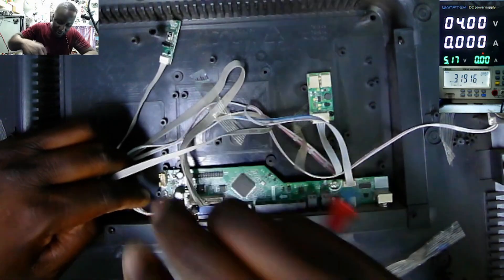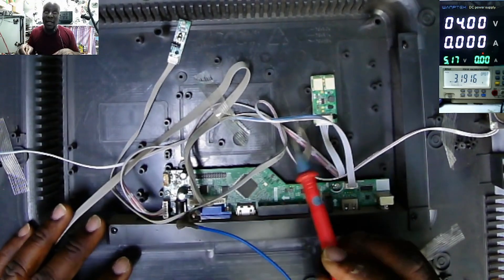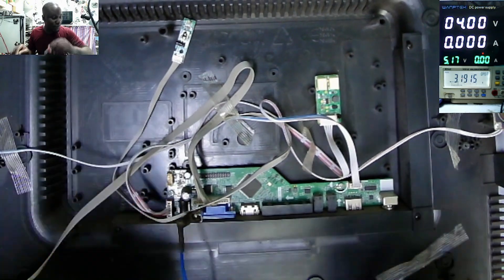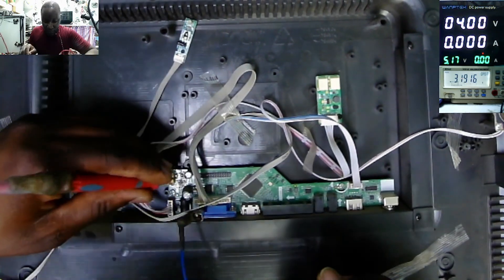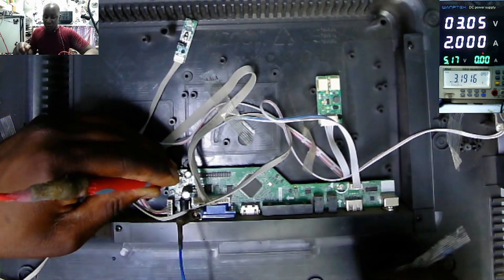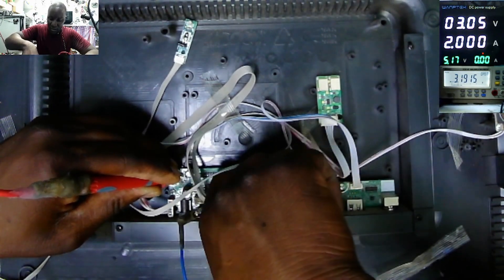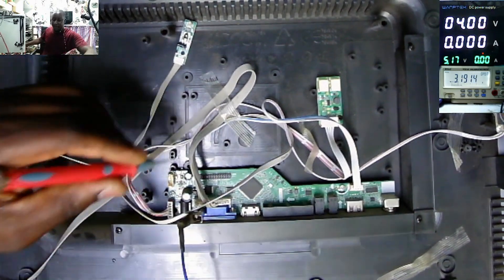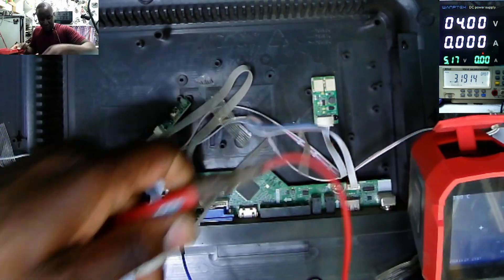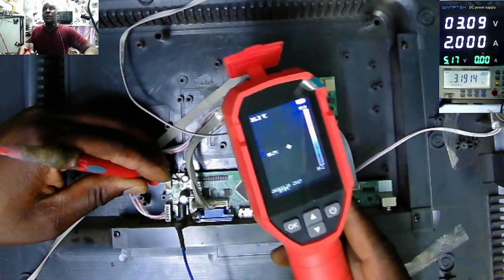Because in most cases on this kind of motherboard, I found a lot of disappointments — the processor is dying so easily. I don't want to waste time. Maybe this is something we can fix. I'm supplying 3 volts and it's taking 2 amps. What is taking 2 amps? 2 amps again.